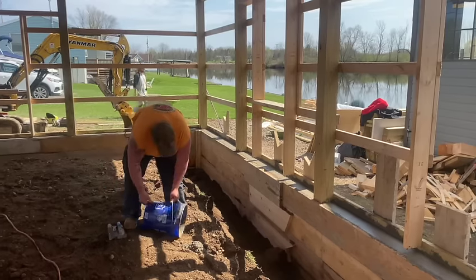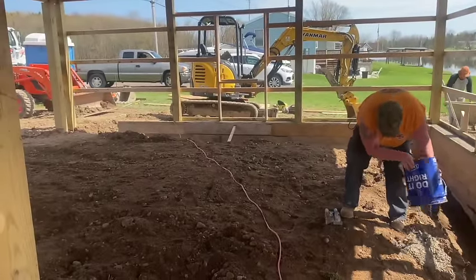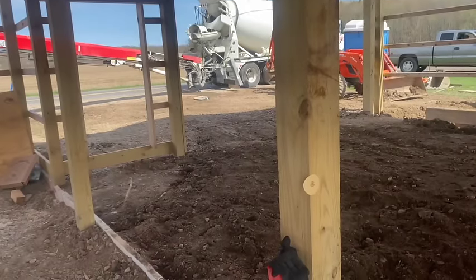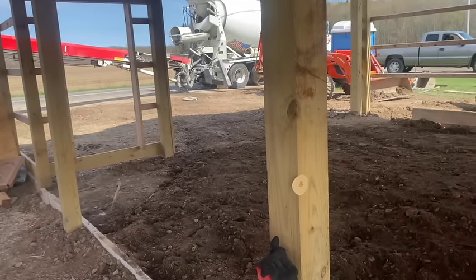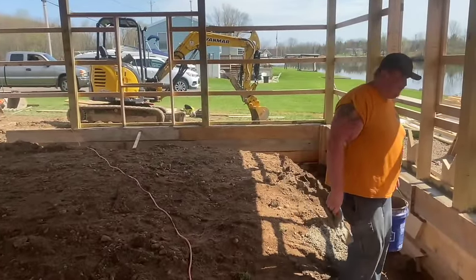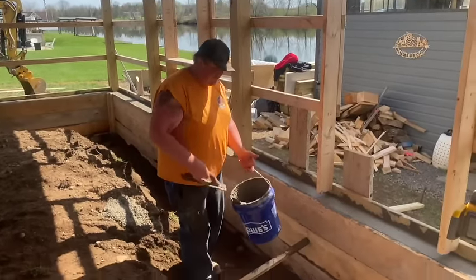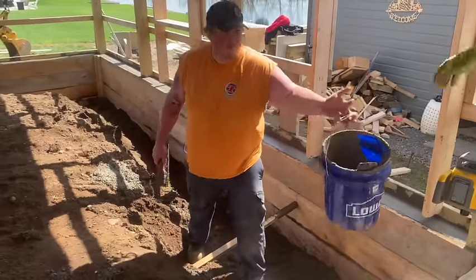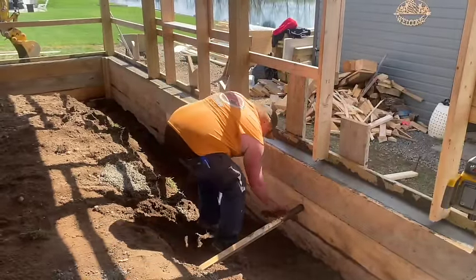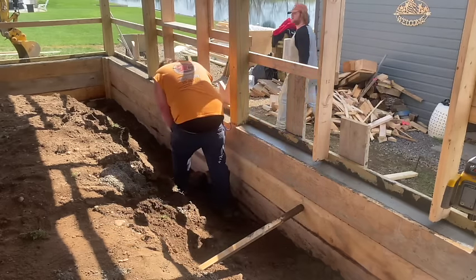We got her, guys. Sean's just cleaning up the conveyor here, washing it up. We had a couple bows. We were gonna vibrate it, but we ain't vibrating it. That concrete was loose. It flowed right down in there. Started to bow pretty good right where Biscuit's standing when we first started. That board down there started to bow right out, and then we got nervous, so I'm going to make an executive decision not to vibrate it and blow this thing apart.